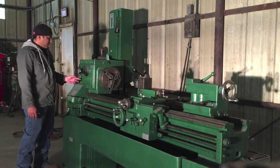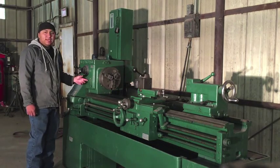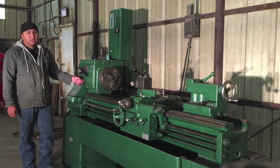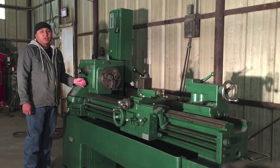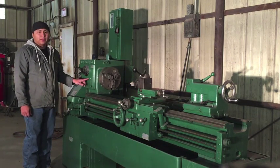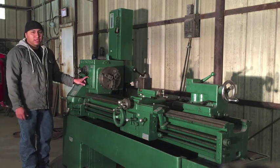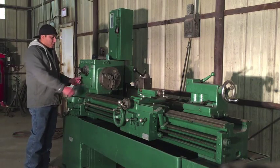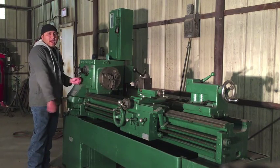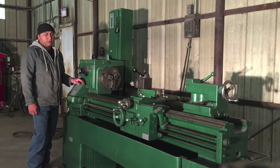So simply to change the speed on this, there's a linkage that's behind this plate. And so when you take the cover off, you can just manually adjust the speed from the linkage that's inside here. So still completely usable. Some people will even go in here and make handles and fabricate a plate for this to turn this into a manual machine.